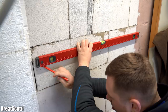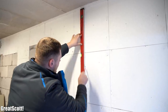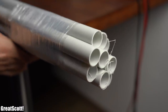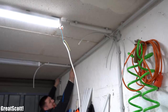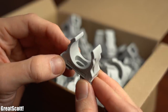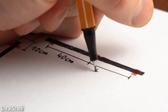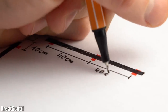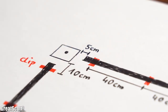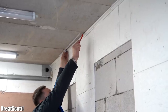Next we marked at a height of 1.1m where the outlets and the switch should be positioned, and also marked lines from the electrical components right up to the ceiling where the cable conduits should get mounted. The conduits hold the wires, and to attach them we use clips. Those clips need to be positioned 10cm away from the entrance of each component, and in theory you need a new clip every 40cm along the conduit's length. The conduit then needs to end 5cm before the beginning of every component. According to those guidelines we marked the positions of all the clips.